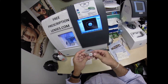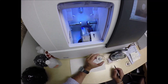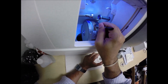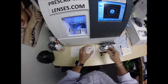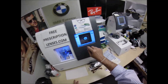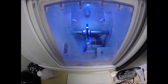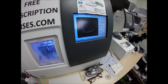I like to call it the Charles, because I just don't know this machine well enough. The actual cutting wheel is this diamond-crusted wheel that's going to grind away your lens material until it's the final size. The wheel in the center is going to put the V-shaped bevel onto the lens so it stays inside the bevel of the frame. Place the magnet into the chuck — the Charles, the chucky baby — and hit the green start button. The door closes, the clamp shuts, and the lens will be traced by two white styluses, making sure it's large enough to fit into the frame on the first go around.